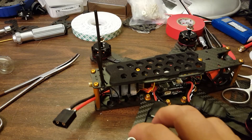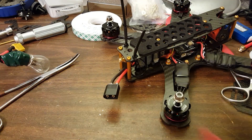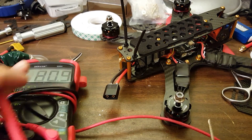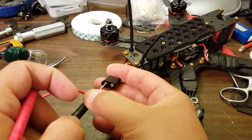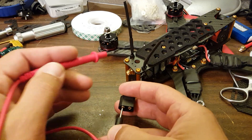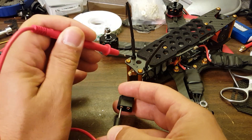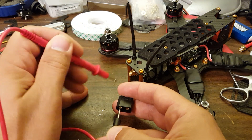And I have a lot of safety checks because I don't like smoking things. So the next thing I'm going to do is just make one final check that I haven't screwed up the polarity somehow. I'm going to get my multimeter and set it to continuity mode, so it beeps when we have continuity. You should have continuity between the ground pin on the XT60 and the other locations for ground. The most convenient location to get ground on most of these copters is the outer barrel of the SMA connector, which is grounded. Now oftentimes you'll find other things getting ground — sometimes the frame nuts will have ground, or screws will have ground, or the standoffs. They'll get it from here really. In this case that doesn't seem to be happening.